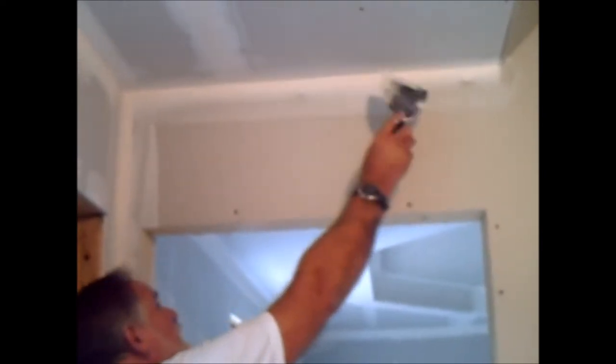And once again, we'll get fancy with it. And we'll put ourselves a nice little layer on there that will make the tape very easy to finish. It'll take a skim coat about the same as this, apply it that tightly, and we'll have a finished corner. And there we go. We just need to do that again, and we're pretty much done. And even these nail gashes here, they'll fill in completely on the next coat like that.